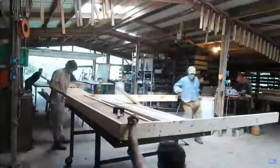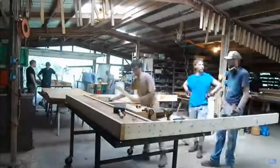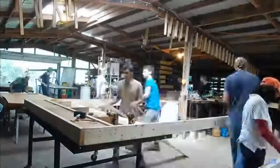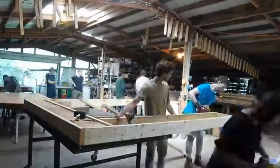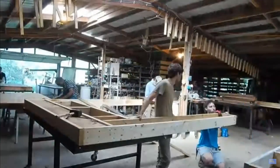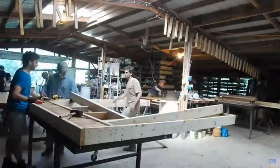Yesterday I sat and watched them assemble one, and I was like, oh, I know what we're doing. And then I was productive the rest of the day. One thing about that is that Katrina showed us yesterday how to start with the lip on the female side, the lip of the plywood. So always start with that side and then fasten the rest.